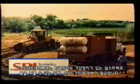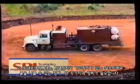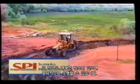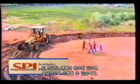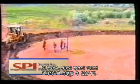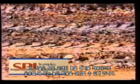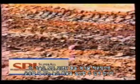Actually, only 2 pieces of equipment are needed for this type of on-site land farming: a water truck with heat and pressure capabilities, and equipment capable of soil movement. This type of remediation is readily performed when sufficient surface area is available adjacent to the cleanup site. This technique eliminates the costly expense of transporting non-hazardous oil field waste to a disposal facility.